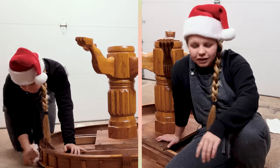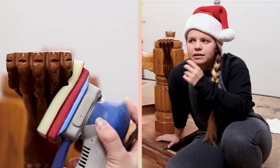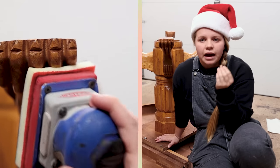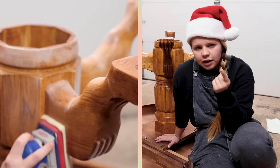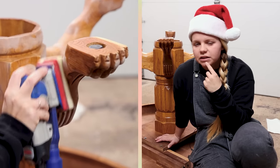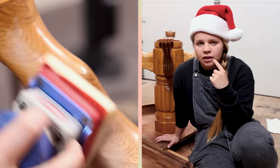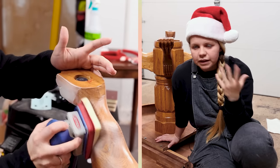Okay, now that we are all cleaned on the table at least, and I'm kind of doing one piece at a time, I guess, because the chairs are gonna be a whole nother story. But while I've got this already upside down, I am gonna go ahead and grab my sander. I could either scuff sand by hand or I could whip out my surf prep sander and it would probably go a little bit faster, and I could use my foam abrasives to help me get into all of the little nooks and crannies, and it also won't damage any of the curvature, because if I use the foam pad, it kind of curves around with all of that.